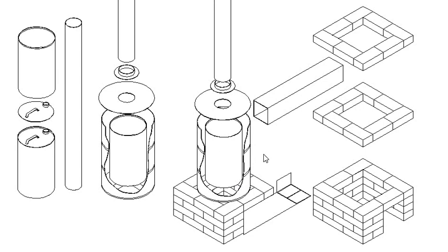If you can buy or pick up some corrugated roofing sheet, ideally galvanised as opposed to PVC coated, I'd suggest insulating this drum possibly with rock wool. If you can get 50mm rock wool around this and then use some builder's band — that perforated metal band with holes punched every inch or so — you can strap it around the outside, put a couple of bolts through, pull it tight, and that would really insulate that jacket. If the plate was larger it would actually cover over the top of the insulation as well. Obviously with insulation you've got to keep it dry — keep it in the shed when not using it, otherwise it would get really heavy and soggy and rust out the metal drum.